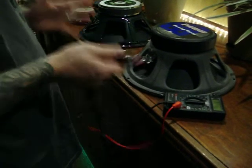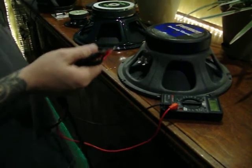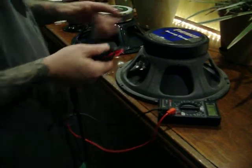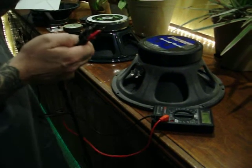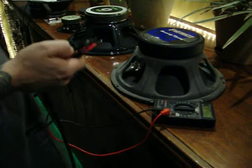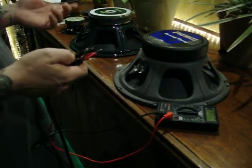No two speakers are exactly the same as far as the ohms are concerned. If you're looking at speaker chart information, that's referenced under what's called RE — that's the more accurate or descriptive exact ohm load. But on average, 8 and 16 is close enough for you to figure out what to set your amp to.